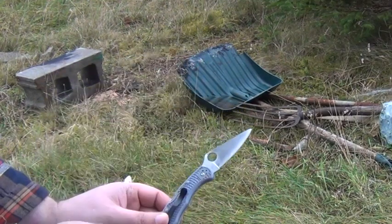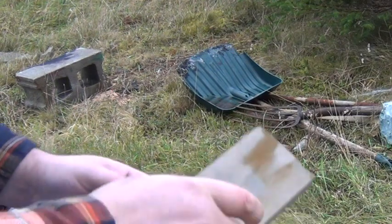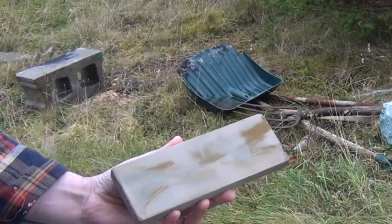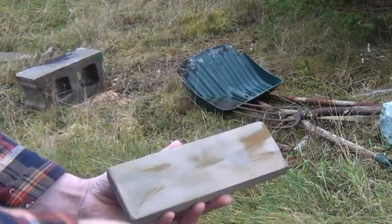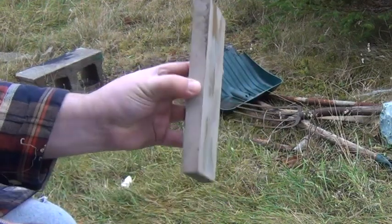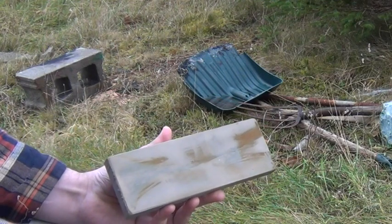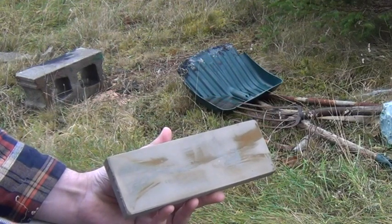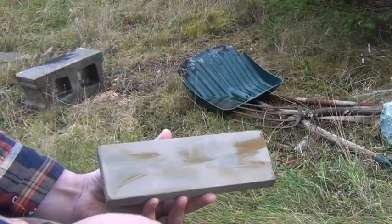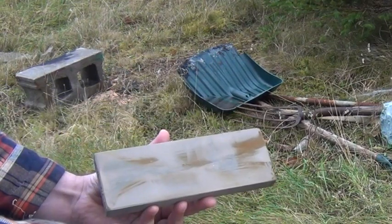To show you just how much of an influence it makes — this, by the way, is just rust. I perma-soak these stones; I don't flush them after I use them. So the very next time — this is dry now because I got it outside, and these stones are quite porous so they dry quite rapidly. As soon as I put this back in water, as soon as I first go to use it, all this comes right off. And this is a shaping stone, not really a sharpening stone, so I'm not really worried about contamination. I don't use this to put on the final edge bevel.